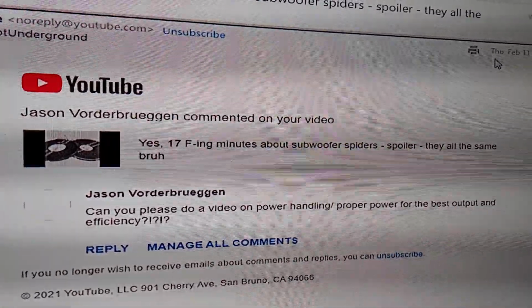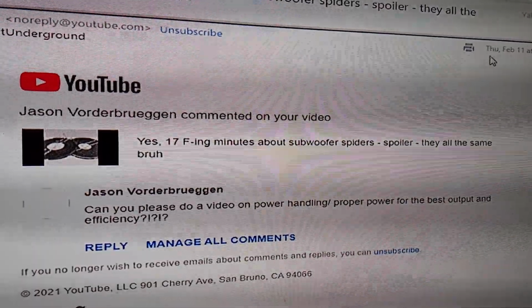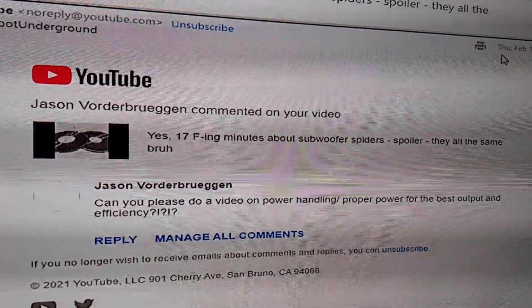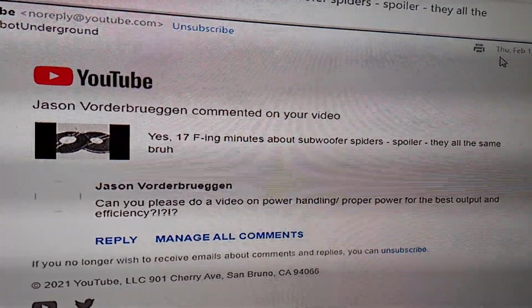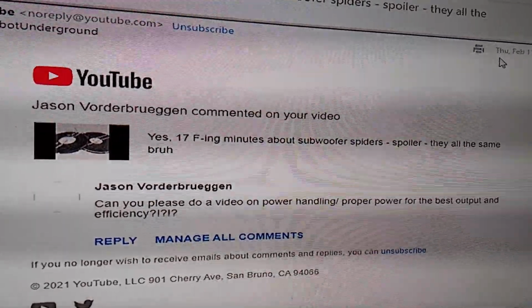So let's say you have an 18 that has an FS of 24 hertz. Well, you don't need to go down to 24 hertz, there's nothing down there. So for best efficiency, you probably want to port to about, let's say, 33, 32 hertz. And what that'll do is give you a really great natural boost, because the woofer can play down to 24 hertz, but it's not. And so what you end up doing is putting that back in there.